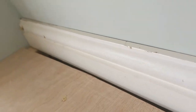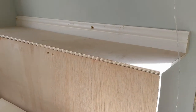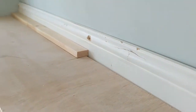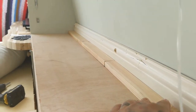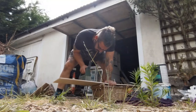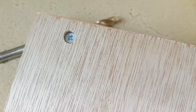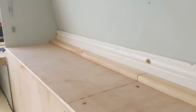See the gap at the back — it's not quite even because we would have needed to buy another sheet of ply to get the height we wanted, and at £15 a sheet that wasn't going to happen. So what I've done is cut down a piece of old timber to make a cover trim, and as you can see, that does the job. On the back of the ply I've countersunk the screws, which gives us a nice seamless finish along the top. So the top is all installed.